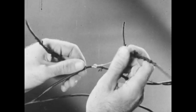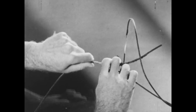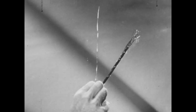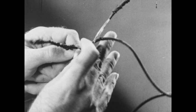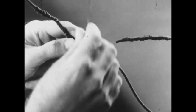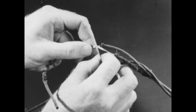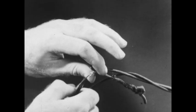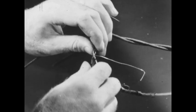With wire, the tie is made so that about one quarter inch of bare wire is left between the knot and the insulation. The electrical conductivity of the splice is improved by using seizing wire. The seizing wire is a strand of copper about six inches long. It is passed through the knot and doubled over. Then the knot is pulled tight. Half of the seizing wire is wrapped to one side of the knot, half to the other.